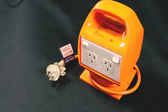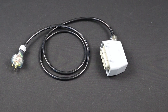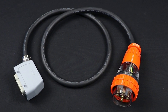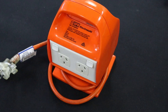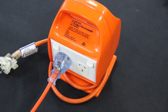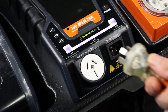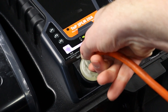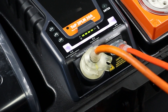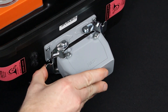For the standard method, you will need the Orange IEC 550 lead, as well as the single-phase or the 3-phase 3PL power lead. Plug the Orange IEC 550 cable into the portable RCD, and if the RCD has a switch, switch on that outlet. Remember to test each outlet of your RCD. Plug the portable RCD into the appliance test socket, then plug the Orange IEC 550 cable into the IEC Earth return. Plug in the 3PL power cable into the power socket on the side of the case.